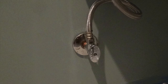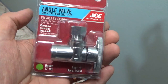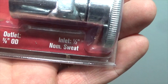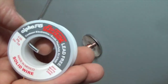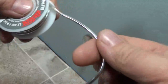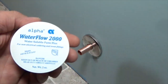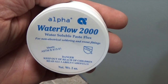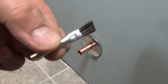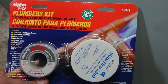This is a valve that you normally find on copper water lines under the sink and under the toilet. Make sure the valve you buy is not a compression valve but is labeled nominal sweat. You will also need the following supplies: lead-free silver bearing soldering wire. Prepare the wire by pulling out about 4 to 5 inches and then fashion a curve on the end. You will also need water-soluble paste flux. This will coat the pieces that fit together before soldering. Obtain a small brush as well — this is the applicator for the paste flux. You may be able to find these as a kit for purchase.